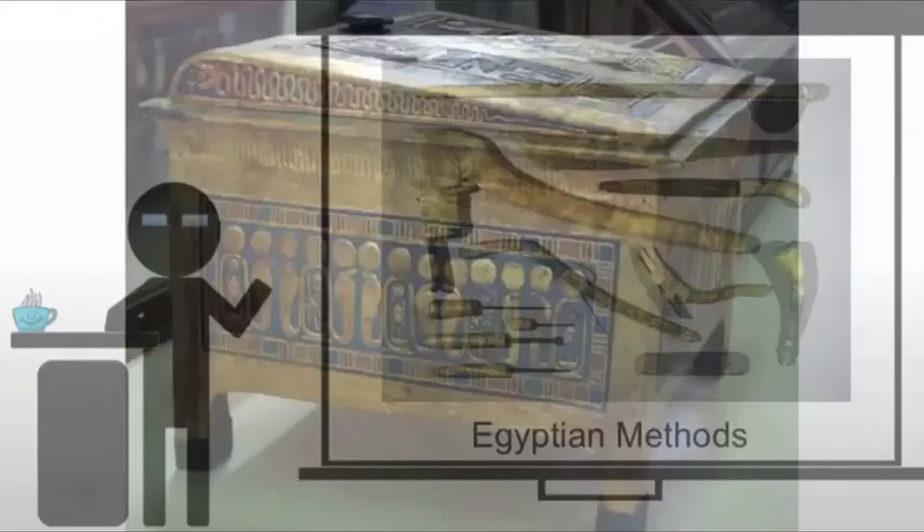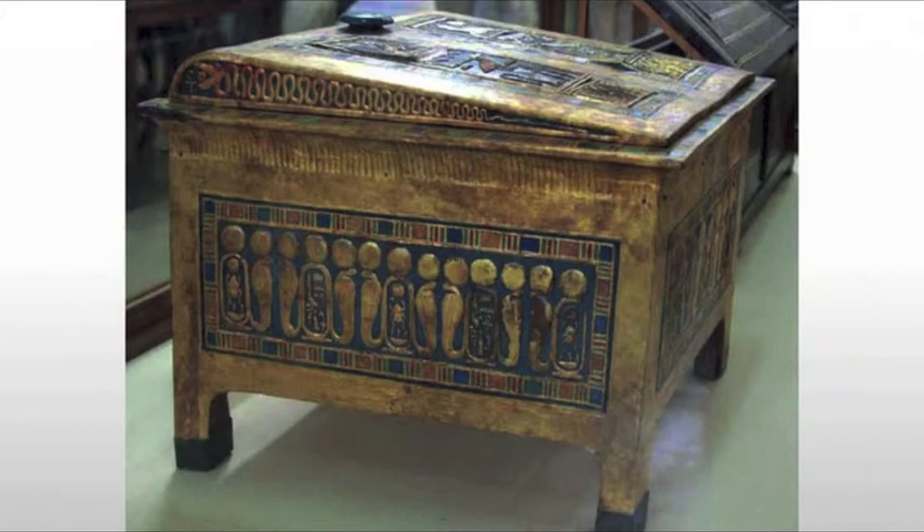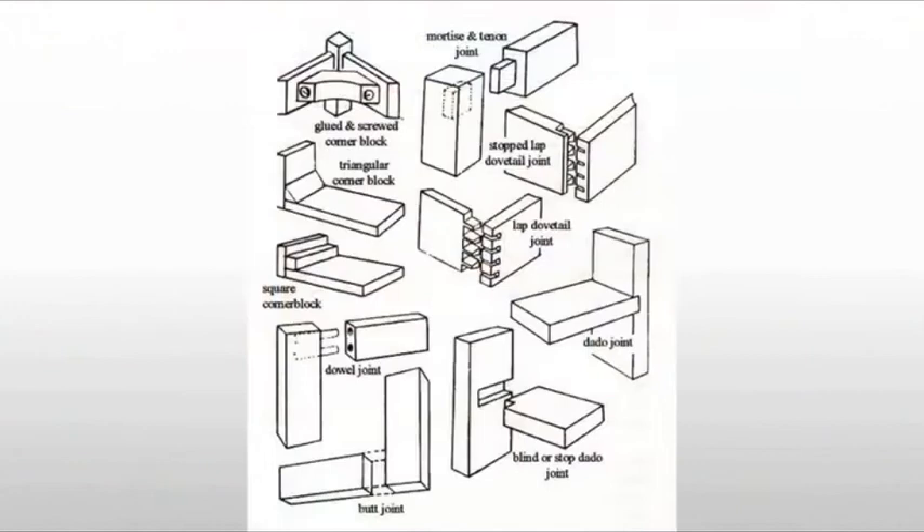The Egyptians used a whole number of different methods. First of all, they're going to use patchwork construction. Looking closely at this box, you can see the different pieces used — a very small piece for the base, a single frame piece around the corner, and a small panel in the middle made up of multiple pieces. Throughout the construction, we see many small pieces rather than one solid carved piece, because large pieces of wood would be very expensive and imported. If you see large solid pieces, you know it's a high-end piece in ancient Egypt.